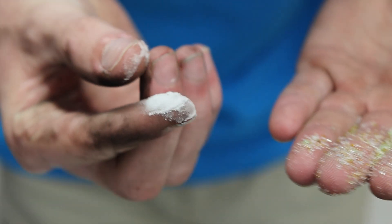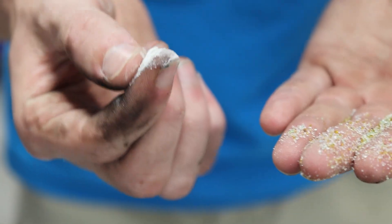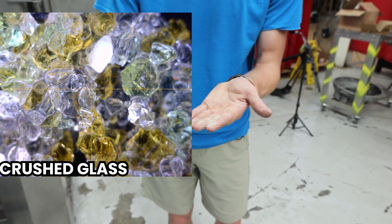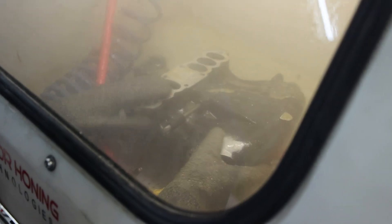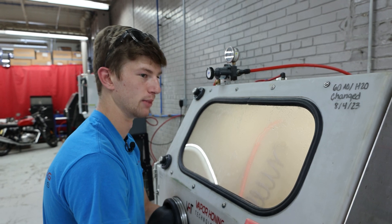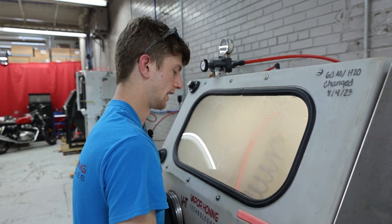Here's what glass bead looks like — the actual particle size is much smaller, and under a microscope it's actually spherical and hollow, so it's not hitting the part nearly as hard. The crushed glass is solid and super angular — great for removing paint, corrosion, anodizing, or anything off your parts. I'll do a quick side-by-side on this corner: the crushed glass had no issue taking the paint off and getting back to bare metal in a short amount of time. Glass bead is definitely going to struggle more, but that's a good comparison of how different abrasives have better cutting characteristics.